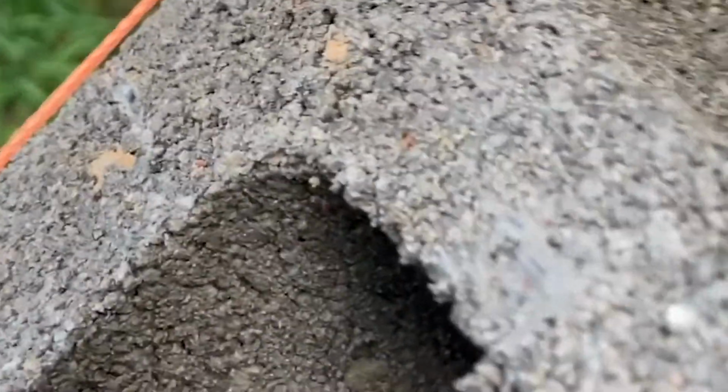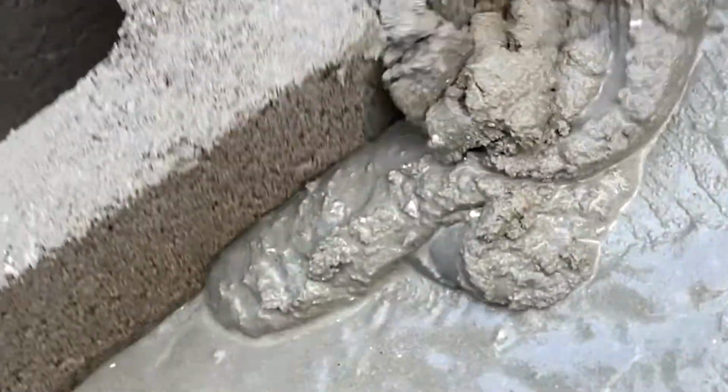Okay, there it is. There's the dry joint. There's the other head joint and the mortar bed it's laying in. So what we'll do is we'll take the hammer and we'll tap it in the middle web. Be careful not to break anything, but what we're trying to do is get a good head joint, and then that will leave us just a little bit of space to fill in. So now we've got a nice head joint. Let's clean that off with the trowel. Show you what that looks like. Just take your trowel, just kind of go along like that.